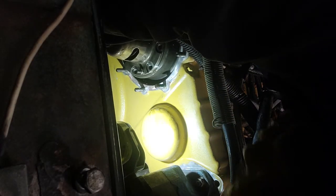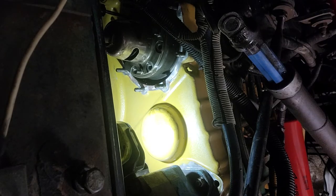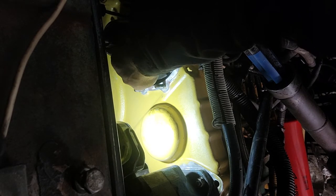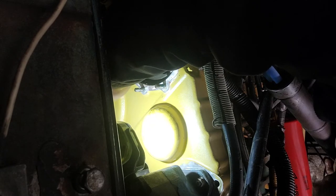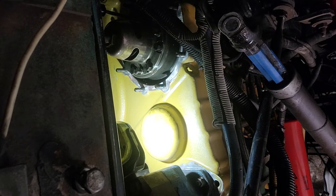Yeah, it's hard guys, but I did it. So always use the screw to make sure it's aligned on the bolt hole. Okay, let's try to put on the bolt. Okay, it's good. So all bolts are put on. Alright, that's not easy, retiming an injection pump.